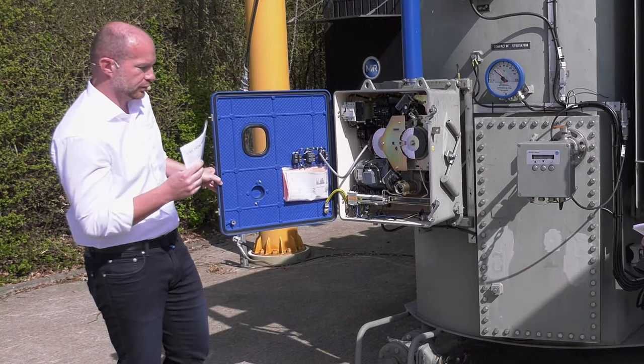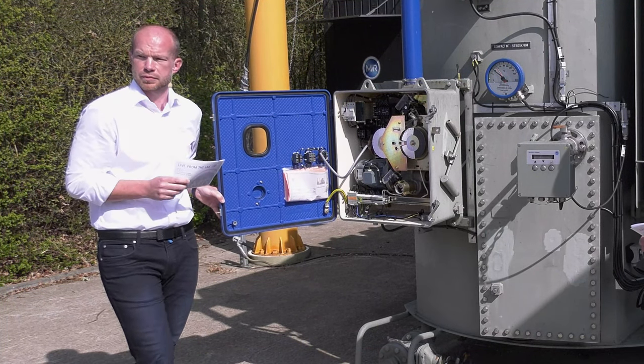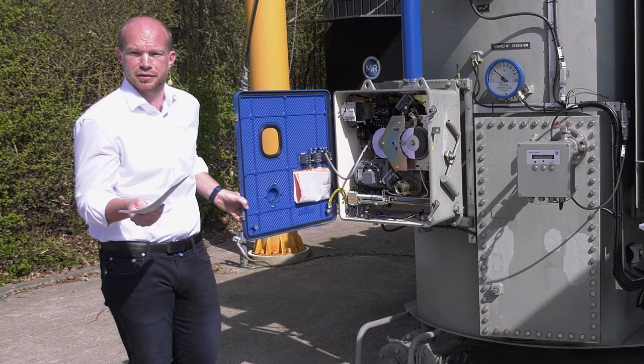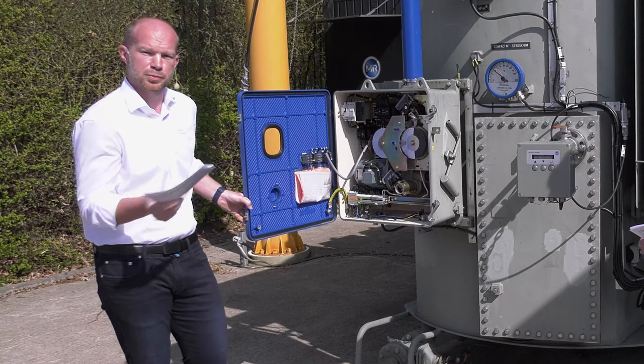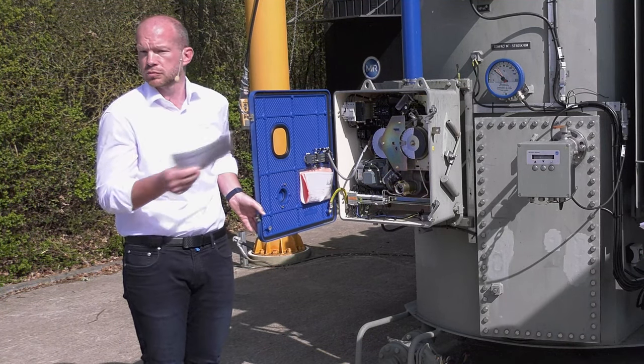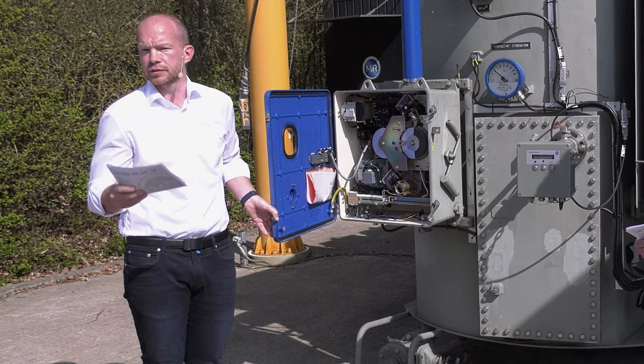Also, we have to know what type of tap position modules are implemented in the motor drive unit. If you're talking about digitalization of a transformer, it could be a BCD signal, or at least just a normal contact range, resistor contact range. We are able to provide all kinds of different modules.